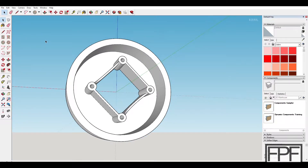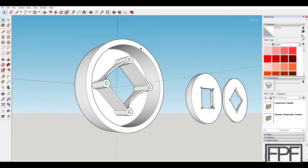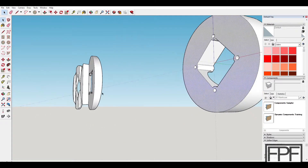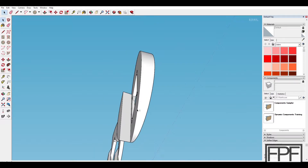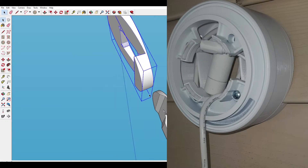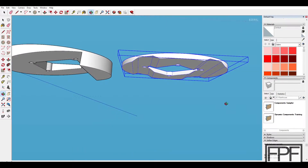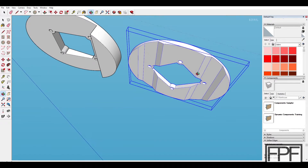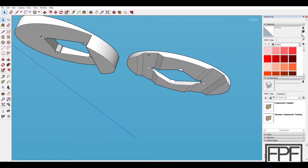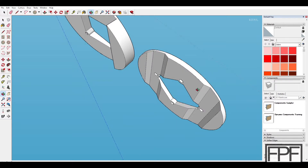He's also got a couple of adapters that sandwich behind it. The camera sits on one face, and these two adapters go on the back face. If you're putting up a camera on the side of your house with vinyl siding, this takes up that gap so you don't have a gap behind the camera. And this other one does the same thing for the stamped sheet metal you typically have on garages and pole barns, so you don't have that gap behind the plate for bugs and weather to get into.